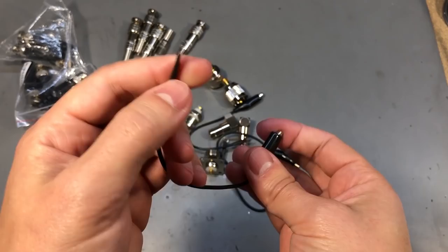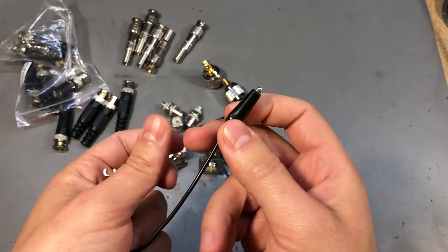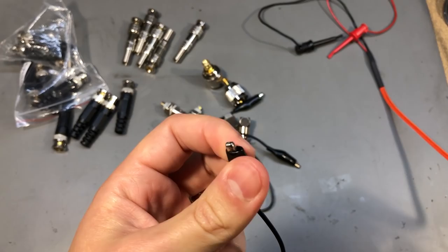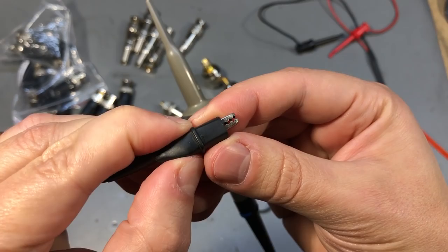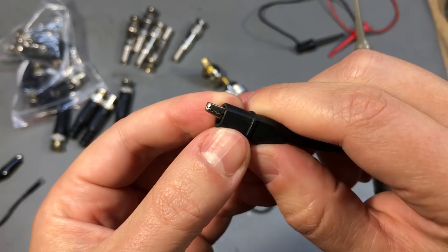Next I have these oscilloscope ground lead type connections, and the plan is to modify them. I have a couple of ideas: attaching a 4mm banana connector instead of the alligator clip, and also maybe a J-clip type connector instead of the alligator clip. That would provide a better way of connecting the ground signal to the oscilloscope while doing measurements, instead of the traditional alligator clip which is kind of clunky and heavy to operate — and sometimes you don't get a good connection on very thin wires.